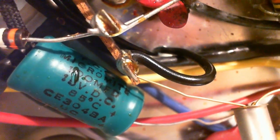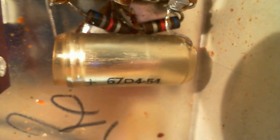100 microfarads and something, so this is probably a bypass capacitor. This other one over here, it's like, yeah, 4. You can see what it's hooked up to; it looks like some kind of balanced thing. It looks like a symmetrical arrangement of components. So this is certainly the discriminator for FM, and almost certainly that capacitor's got to go.